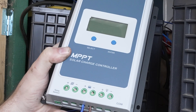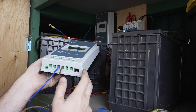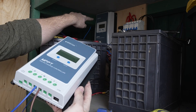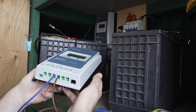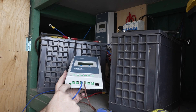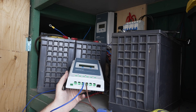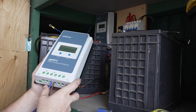You can also have a load positive and negative, so if you want to run lights you could have them turn on at night through this controller. I'm just going to wire mine directly to the battery so it's always on. On this one there's a communication port, and I do have a screen hooked up to that which I'm going to temporarily move over to this one so we can program the custom battery voltage. There's also a temperature sensor you could use to cut off charging if the temperature is too low — though the batteries have that built in with the auto-heating feature, which is super cool.